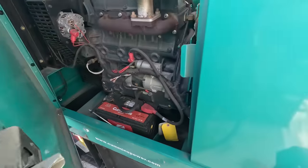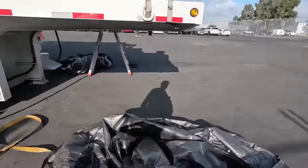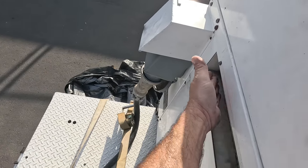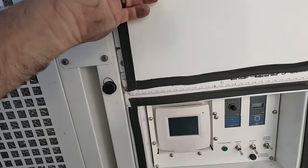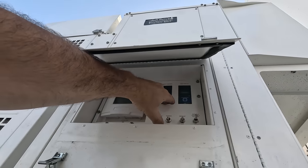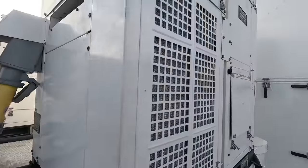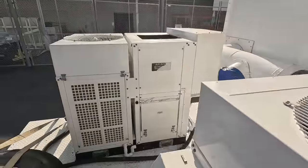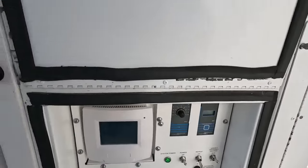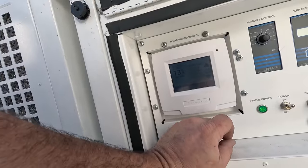Let's go ahead and focus on our main thing here. Practically go deaf. So now we just got to turn these on — we can turn on the circuit breaker, come down to the thermostat. Last time I used a piece of tape to hold that up. Turn that one on. Reheat's off. Now you can only run one of them on reheat, which is electric reheat. The generator can't handle all of it unless you ran each one individually. I thought we were only going to run one at a time, but it appears we're going to run both air conditioners at the same time.